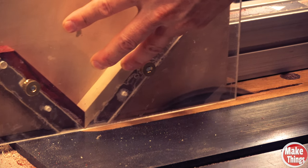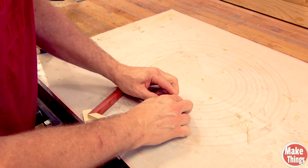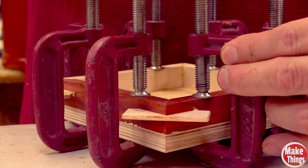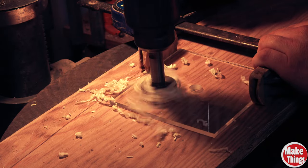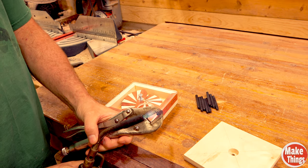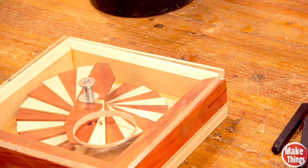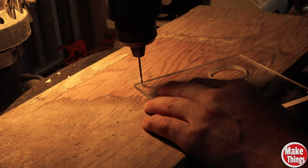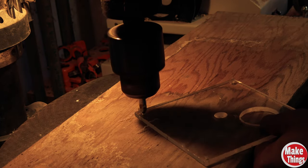To keep the edges together I used my spline jig. You don't need to add splines or even miters for this box, but what I like about my spline jig is that I can use it before the miters are glued, allowing me to use the splines to hold it all together — no clamps needed. I then attached it to my base with glue and clamps. After sanding the splines off I cut a one and five-eighths inch window in the acrylic, which allows me to spin the blades and insert the router bits. I chose to burn numbers on for identifiers, though I'd probably just use pen if I were to do this again. I finished by marking all four corners with an awl, drilling the acrylic on the drill press, using the acrylic as a pattern to drill out the box, and countersinking each screw hole to keep the screws below the surface.